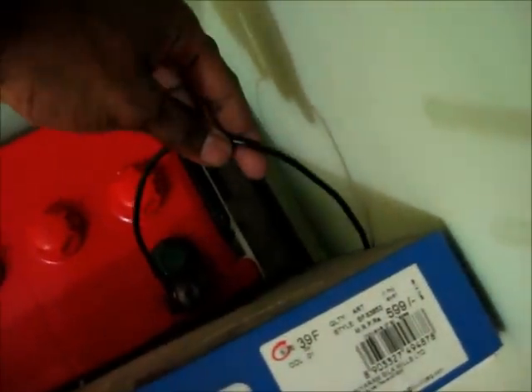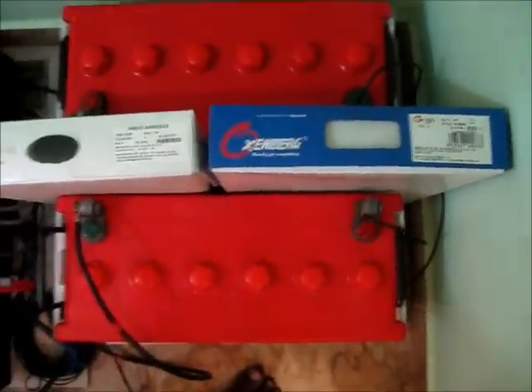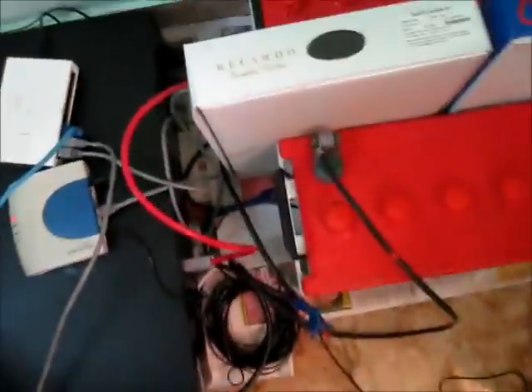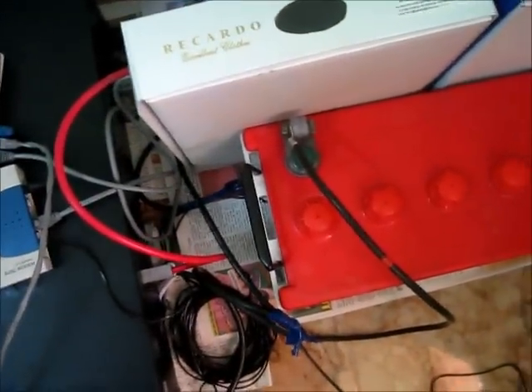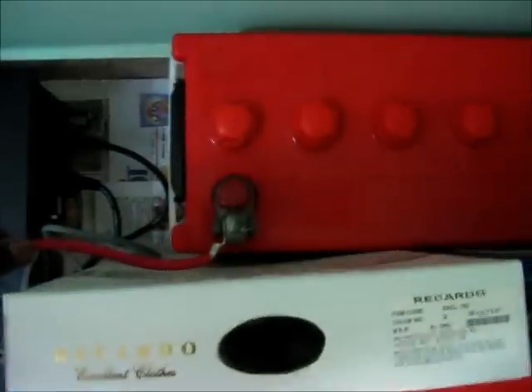You can see that I have used a connector which connects to the negative terminal of the first battery and the other end is connected to the positive terminal of the second battery. This is for series-connecting the batteries. The male connector is used for connecting the two batteries to the UPS system — the red cable connects to the positive terminal of one battery, the black cable connects to the negative terminal of the second battery, and the socket connects to the UPS system.